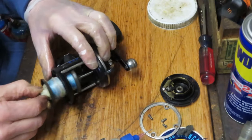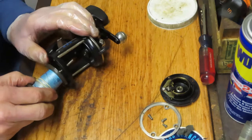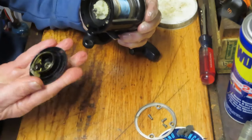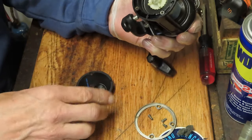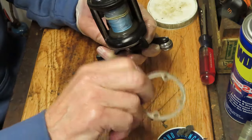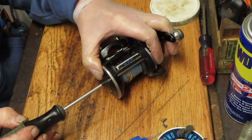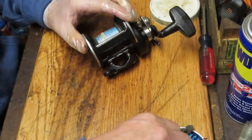Something's not right yet. Let's take this out. Let's put the bearing with the case this way and take the tension off of it. That's a whole lot better. If you find something is binding, don't force it — just step back for a moment, ask yourself what could go wrong, reset, and generally you're going to be better off for it. The name on the side plate is usually parallel with the base of the reel. Line up the holes and bring that trim ring in. I fully expect that this reel will work nicely now — I think we identified the issue. It was this frozen bearing.